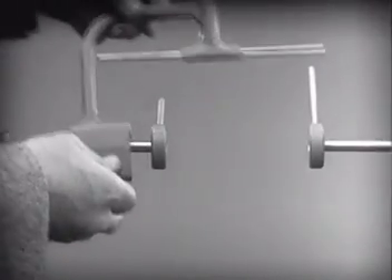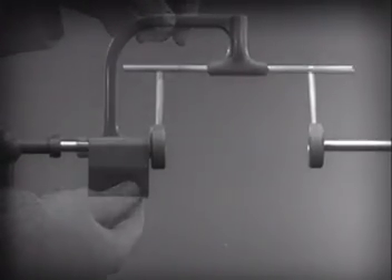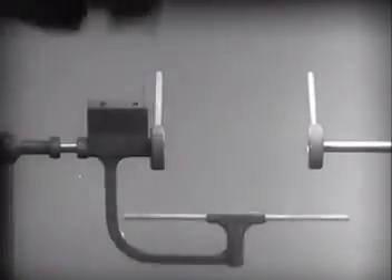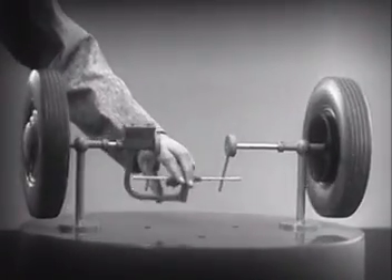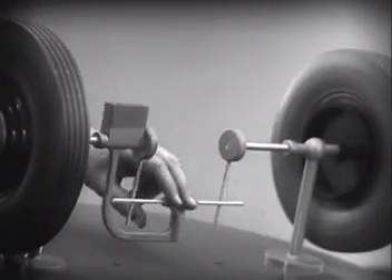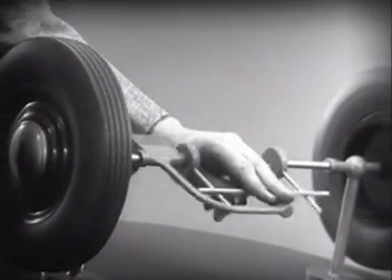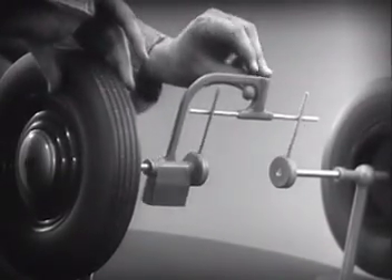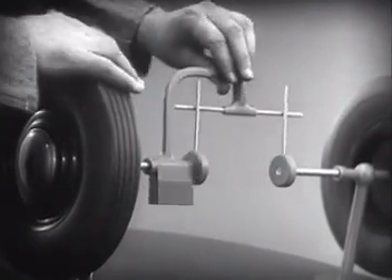Let's get something to hold this bar in place so that it will press against the spokes. Notice that this support is not locked to the axle — it turns freely. Now we can spin the wheels by rotating the support. This is fine as long as both wheels are able to turn at the same speed. But when we go around the corner with this arrangement, we cannot drive one wheel faster than the other. And if we stop one wheel, the other wheel won't budge.